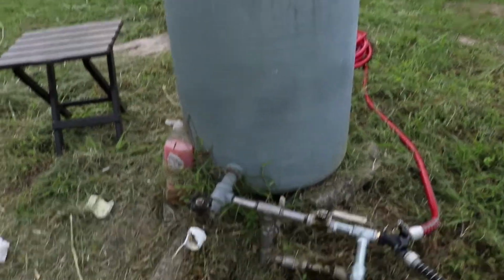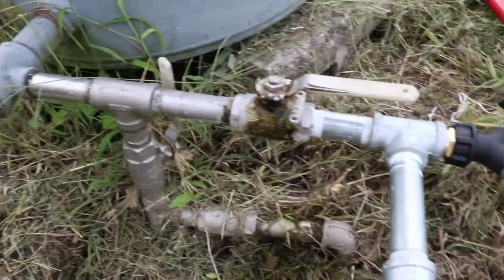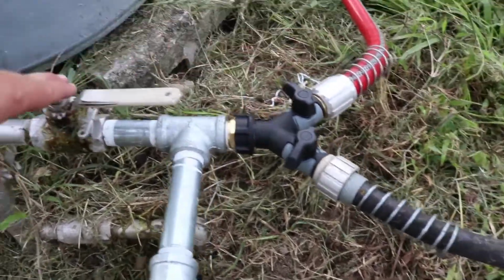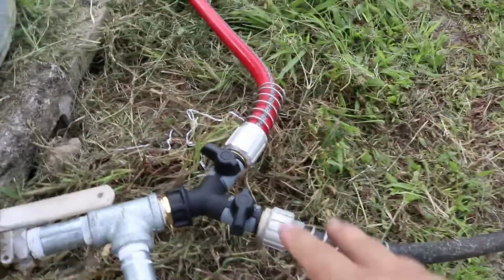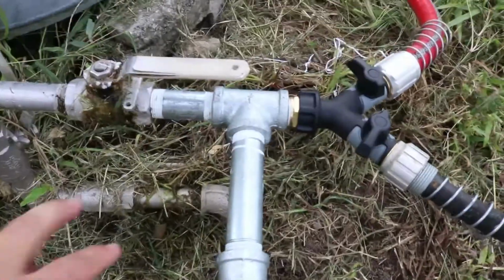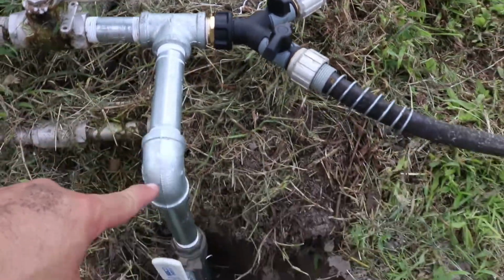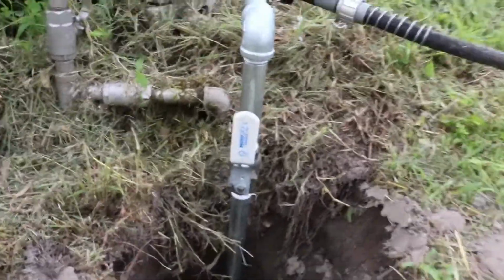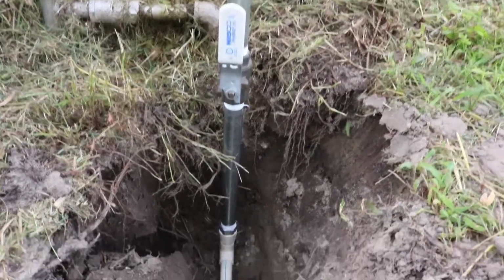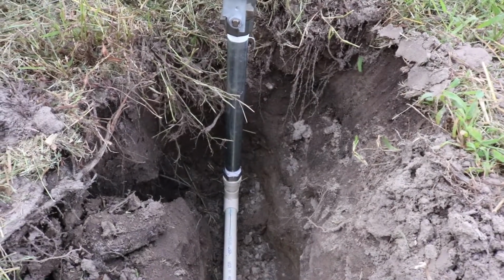This is the pressure tank here, the flow out valve, and then we come across here. This is to like the yard hoses, okay? So this is like where we do the cow trough and clean other stuff with these hoses. So basically I added this piece here, teed off, came over, 90 down, and then I put in that ball valve, came down further, transitioned to the CPVC, okay,